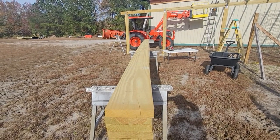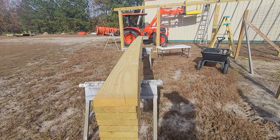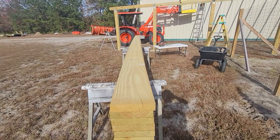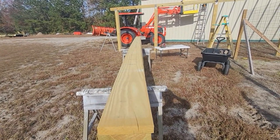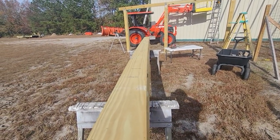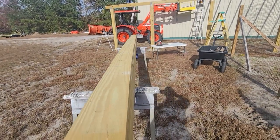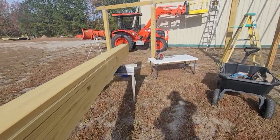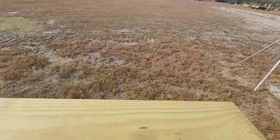Most of this lumber came from Lowe's, which is not the greatest place to get it, but it's hard to get lumber at all right now. Most of their boards have no crowns — I really have to look at them and try to decide which is the best side to use. That one will give you a good idea of what crown looks like. You want to make sure they're all the same, so I'm not going to cut that one — I'm going to swap that one out.